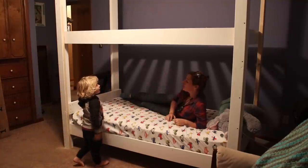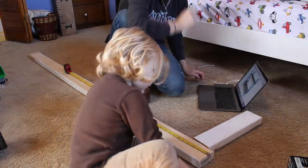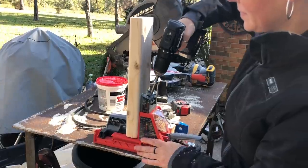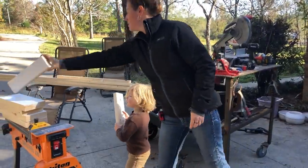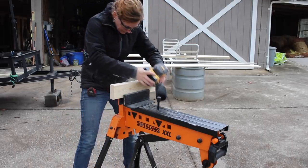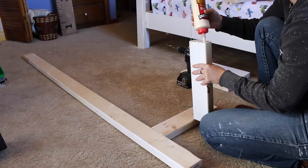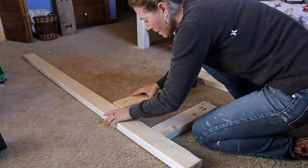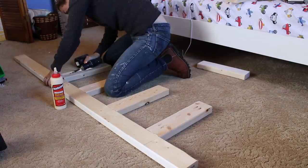It is easy to get an early start when you have a three-year-old telling you it's wake-up time and that he would love you if you built his bed. The next morning I started off by building the ladder, which is made up of simple 2x4s. After cutting the pieces to length each one got a few pocket holes so they could be attached to the main board. Since these steps will be in contact with little feet I recommend using a router and a roundover to soften the top edges — or if you're like me and didn't have one, use a sander to do the same. I used wood glue on all of the ends before attaching with screws. Components that make up the larger assembly typically get glue, such as the rung on the ladder, but I would skip the glue when attaching the ladder to the bed frame so it can be removed if needed.